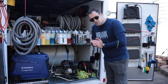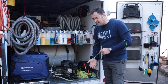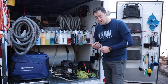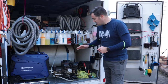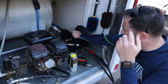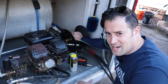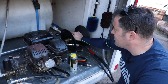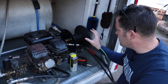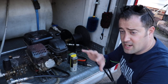Let's show you how to draw from a water tank like this with your pressure washer. This is going to be for a gas pressure washer, not an electric. If you have an electric, it kind of depends on what type it is — some of them can prime themselves, but it all depends on your setup. I'm going to drain this whole system and show you how we prime it. When you are connecting all of this stuff together — I'll put links down below — this is a 50-foot pressure washer hose. A lot of guys are starting their mobile detailing business and want a 50-foot like this. You can get a 100-foot, but this is so small and compact.